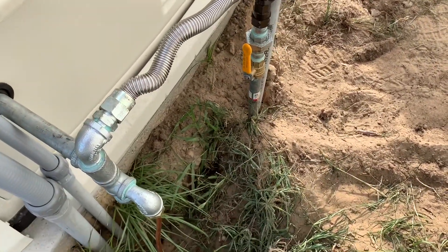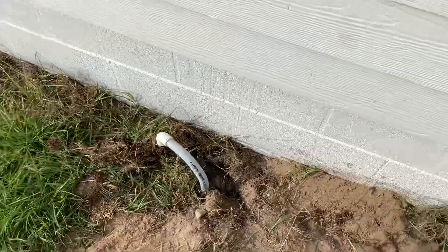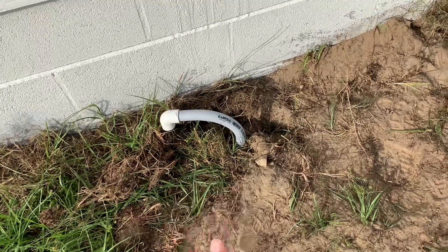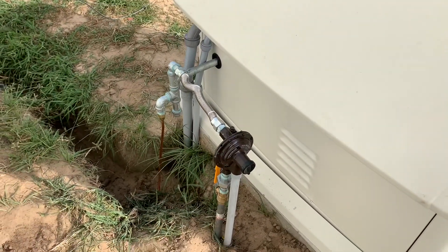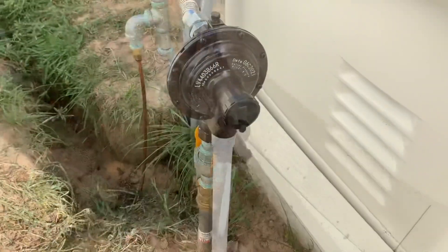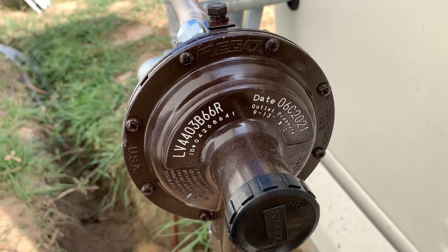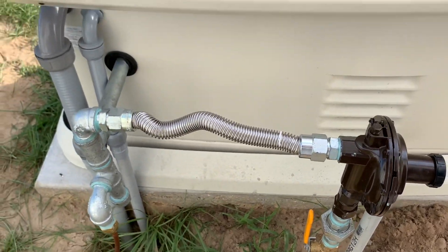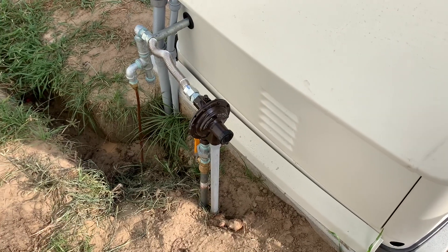It's pretty simple how they set it up. It looks like they have a vent over here. I don't understand propane all that much, but I do know the vents on the lines have to be away from electrical panels, AC vents, and condensing units. This regulator has an outlet pressure of nine to thirteen inches of water column. I'm not sure what the pressure is on the lines — I'm guessing it's probably five pounds, but I'm not certain.